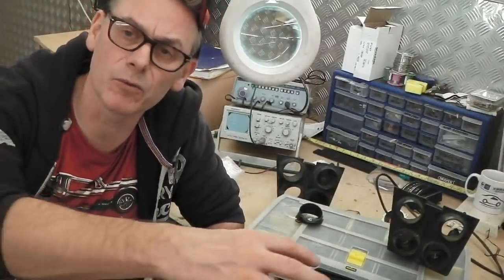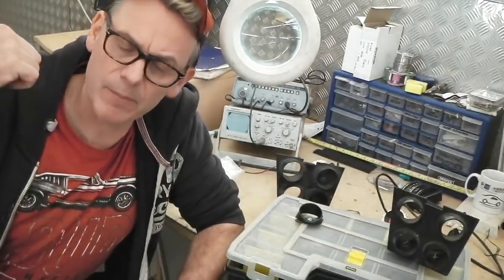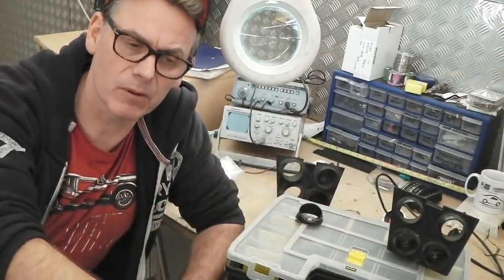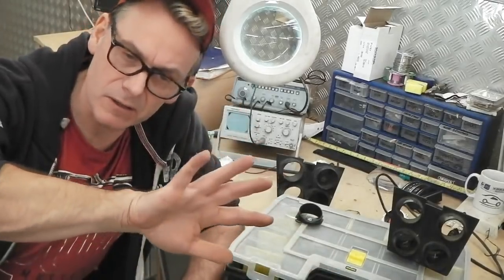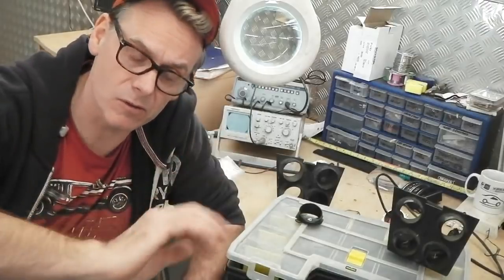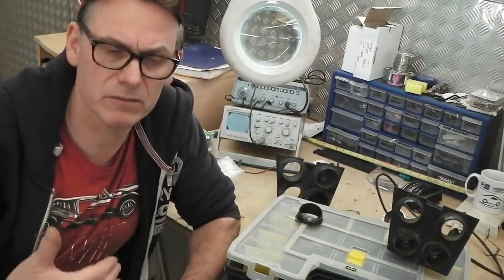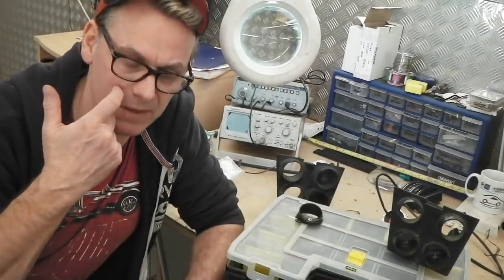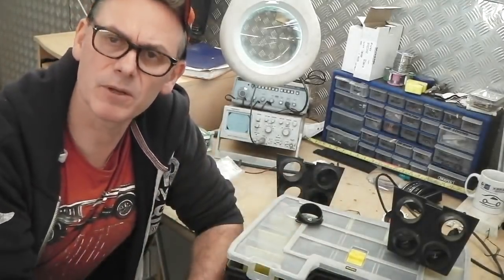This is called aeroflow, where air comes into the cabin and then exits through the apertures in the back of the car, so into your scuttle, into your heater box, through your fresh air vents, sort of half pressurising the car as the ram air goes along, then stale air removed, and the aim was to replace the interior volume of air every so many cycles a minute would be a change of air, or so many cycles an hour change of cabin air to keep it fresh.